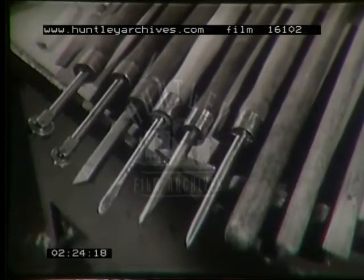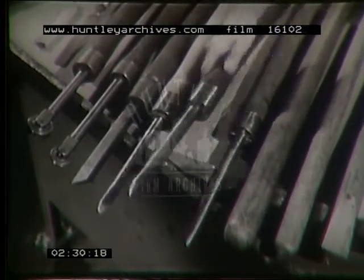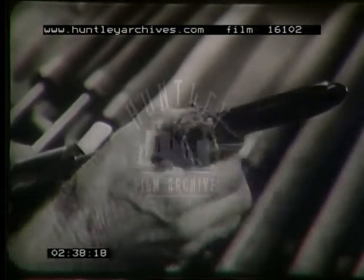Spinners' tools must be kept smooth and bright. The more nearly glass-like they are in polish, the better job they'll do. They should be buffed lightly any time they start to drag, and touched with light oil. But so much for the tools. Let's look at the metal.